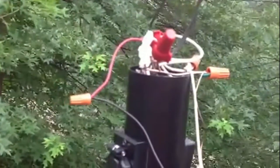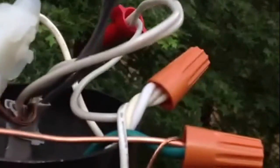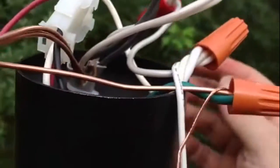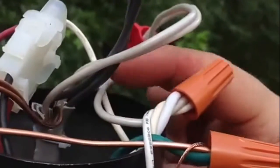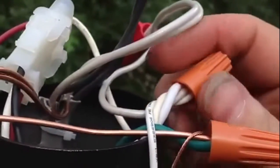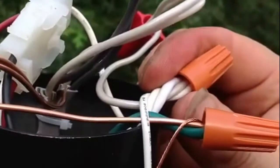I know I have a lot of wires here, but I'm trying to explain. We have our light fixture here. All the wires — all the white wires — they all get hooked together right here. All the lights get hooked together. This is my pigtail white, so bring them onto that. All those whites get hooked together. So we have our pigtail whites, and that brings us down to one wire. That wire goes around here and up into here, and then all the white wires get hooked together.